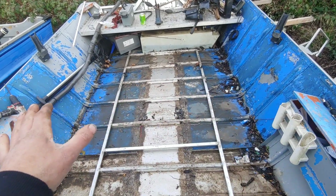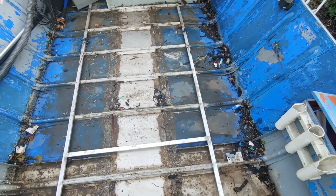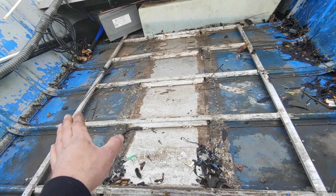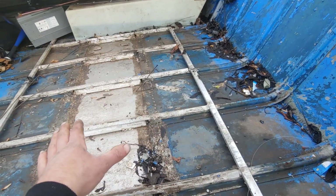I'm going to put that pink insulation board between every runner, and I'm hoping that I might be able to cut it in such a fashion where it fits these contours and maintains a flat structure. And then once I get all my pieces cut out and this is clean, I'm going to glue it down.